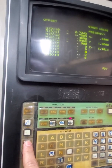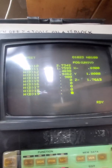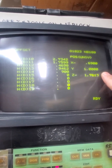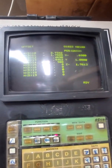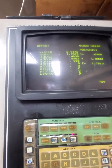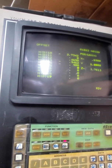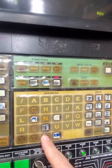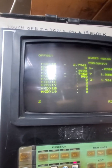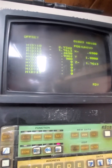Cursor up and down — there's tool 11. You can see it: T211, cursor flashing there, and my universal position is shown here. I'm at zero and touched off where I want to be. Here's the magic that nobody seems to know — a lot of people are complaining they have to type in all these weird numbers. Let me zero this out to show: I'll put in zero, so T211 is zeroed out now. All you have to do is put in Z, hit Write — there you go. No typing numbers at all.